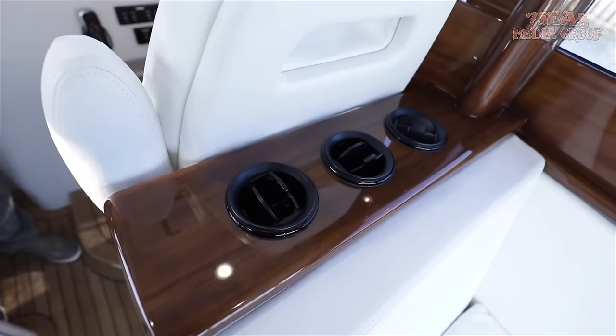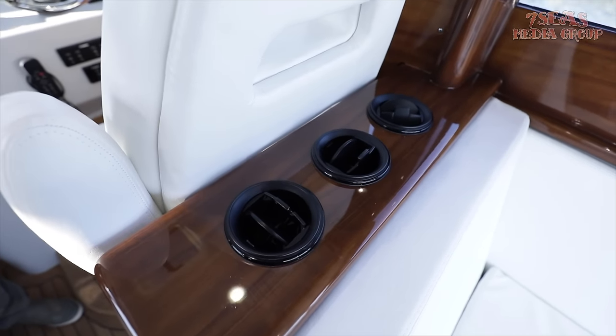We also, through these sea chests, have our air conditioning and refrigeration plumbed off of. The AC and refrigeration is plumbed with a 2500 Hooker pump that's variable speed, and we set the speed based on the water needs of the compressor to cool down the refrigeration or the air conditioning.